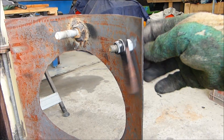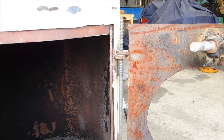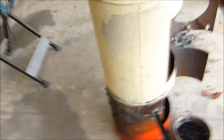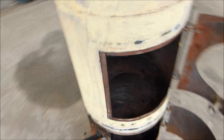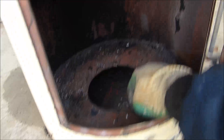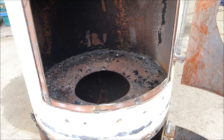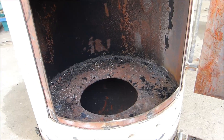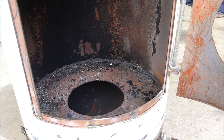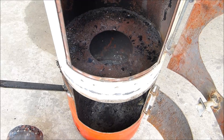Simple closing mechanism and hinge — very easy. There's a bit of welding on this stove, but it's possible to make the actual conversion from a propane tank to a stove without welding, even including putting this division to make two separate chambers. If you had no welding equipment or no ability to weld, you could cut the disc and put some sort of a shelf on the inside for it to sit on, and put some fiberglass or asbestos-type — not that asbestos is available — but some sort of similar item to seal it, bolt it down.